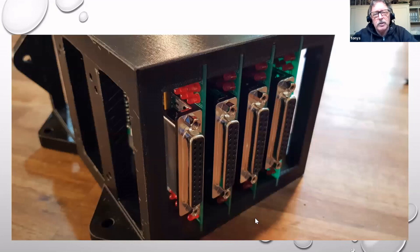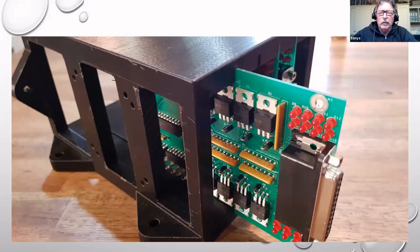You can see how the cards slide in and out. Typically the S100 bus had a plug-in edge connector at the back - I'm not doing that. What we've got here is an eight-output MOSFET output driver card and eight inputs, with LEDs at the top and bottom. To allow the card to slide in the rack, I had to keep components away from the edge of the board.